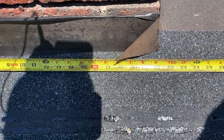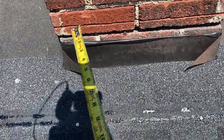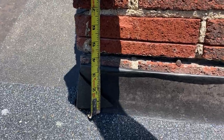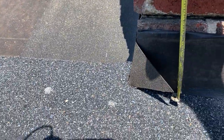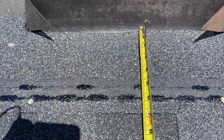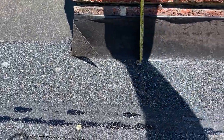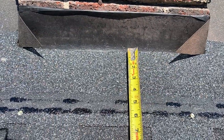The width of the piece I'm going to make is just a little over two feet — about 26 inches. I'm going to bend this piece going into the groove I cut: seven-eighths of an inch in, then down from that groove about five and a quarter inches, and then a six-inch flange down onto the shingles. So: seven-eighths into the chimney, five and a quarter down from the bend, and six inches down onto the shingles.